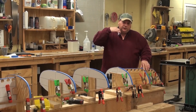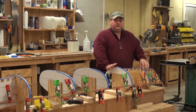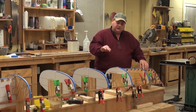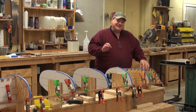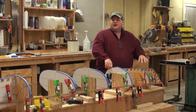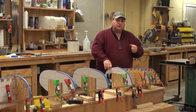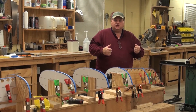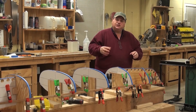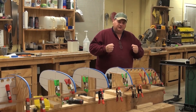For those brave souls following along without watching the whole DVD first, there are a couple of things I should tell you about epoxy. It's just a glue, whether you're gluing fiberglass on the boat or gluing pieces of wood together — but it's nothing like yellow glue. You'll see I only have simple little spring clamps on there. Epoxy, unlike yellow glue, does not like to be clamped really hard. The last thing you want is to squeeze all the epoxy out of the joint. Just slight tension, firmly together, and the epoxy will do the rest — it will penetrate the wood and be very, very strong.